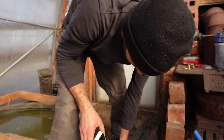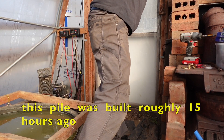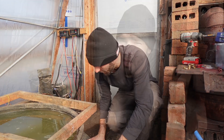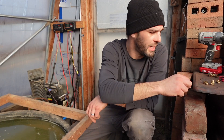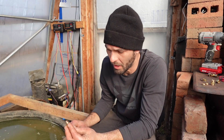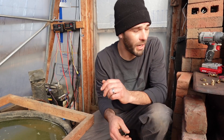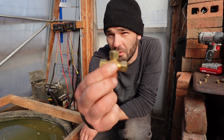We've gotten up to 65 degrees coming out of our little compost heater — pretty darn cool. We're already blowing good heat out of there. We use a lot of compression fittings. A compression fitting uses a little collar that slides over your copper with a compression fitting nut. I had to cut off the old compression fitting on our copper because it was all junked up — possibly twisted — and it was locked on there and wouldn't come off. So I ended up buying new compression fittings, including a three-way compression fitting.